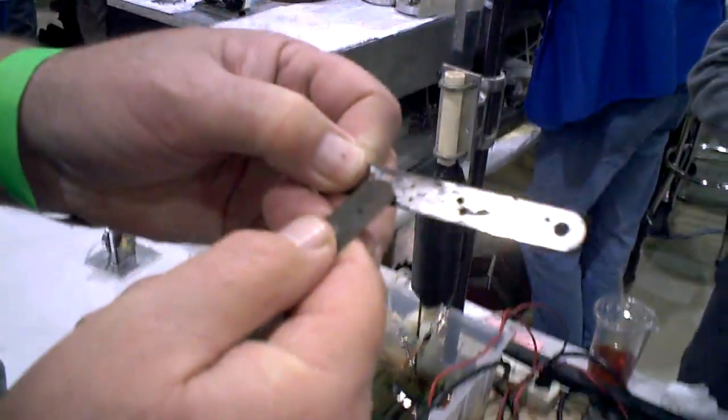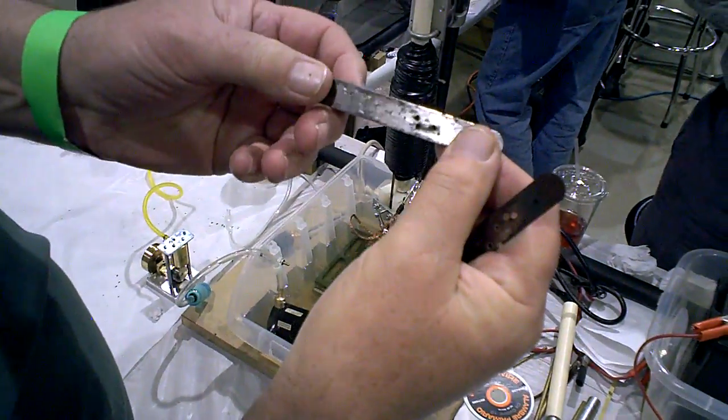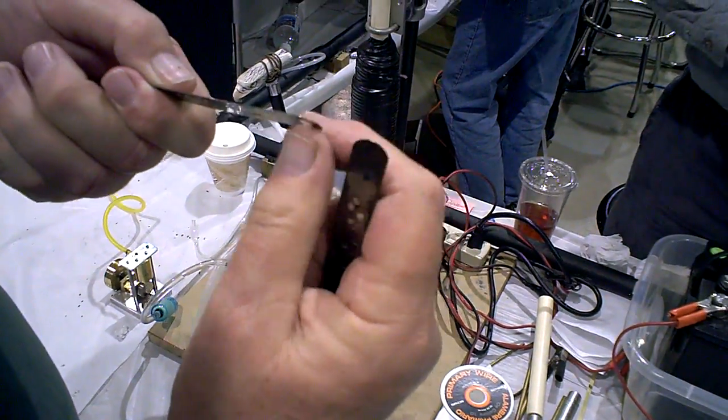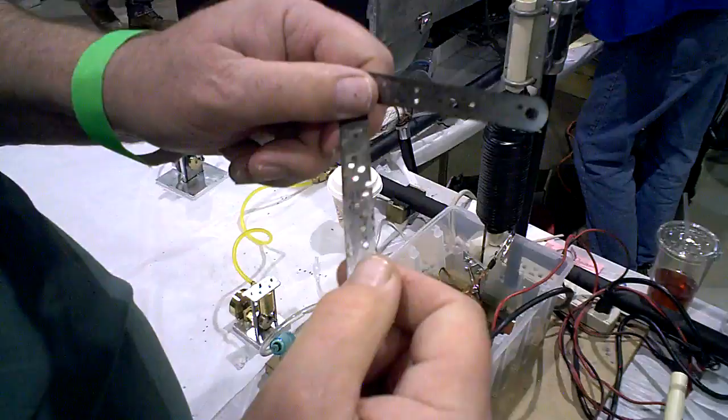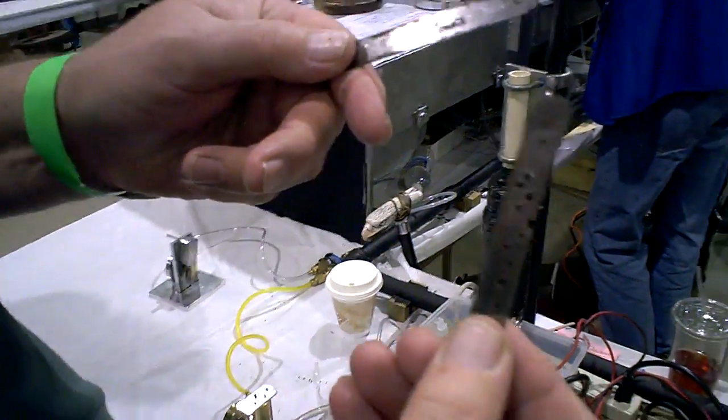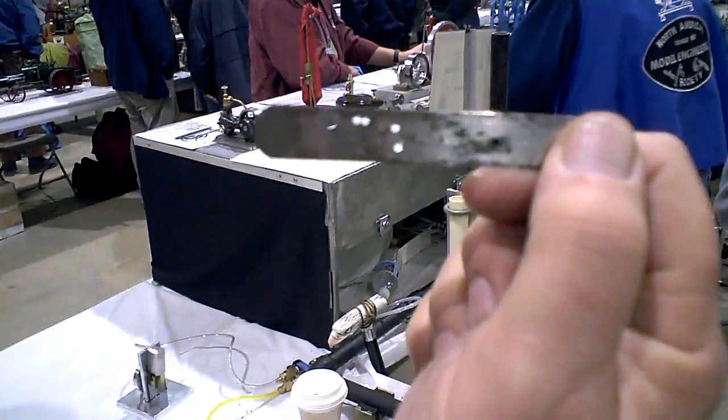See, this is his first hole — see how clean they are? On both sides? And how small? Then, as your water gets contaminated, you start getting erosion and it just gets worse and worse. That's the downside. But that is a dang nice hole for us.